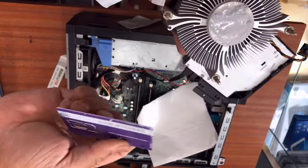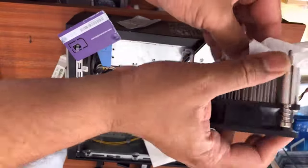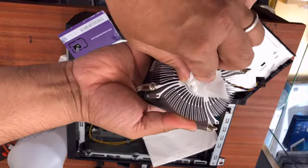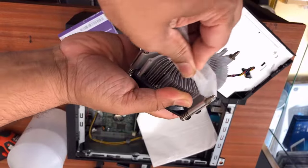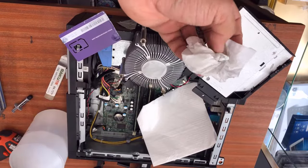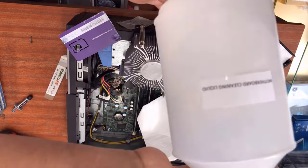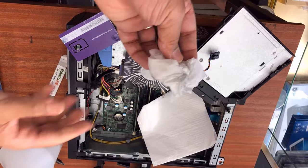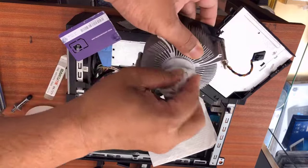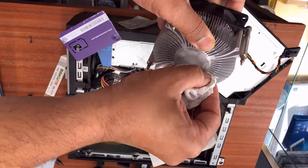The plastic card works like a razor blade to clean this up. Now wipe it off with a blue cloth, any damp cloth, or if you don't have one, you can use tissue paper. Respray again — this is 99.99% rubbing alcohol, which is brilliant for cleaning the PCB, heat sink, and similar components.